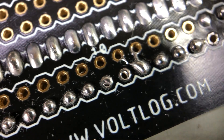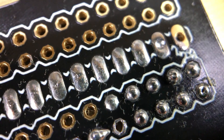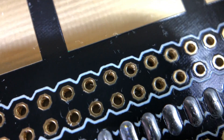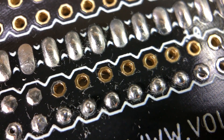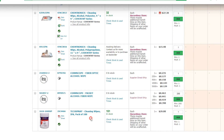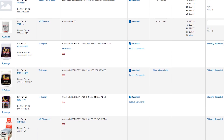But this comes with another disadvantage — you are now left with some lint residue from the paper towel. And in this example I don't even have the sharp pins that you'd normally have on an assembled PCB, and those can really tear up the paper wipe and create all of this lint. There are dedicated alcohol wipes you can buy for this purpose; they work great and don't leave any residue, but I find them expensive at 20 to 30 bucks for a 100-piece pack.